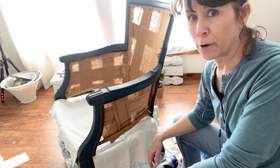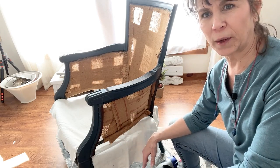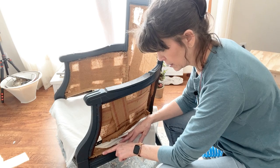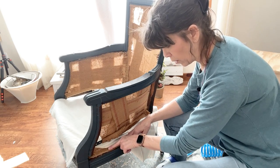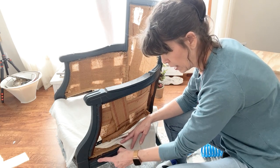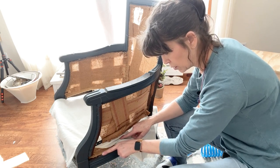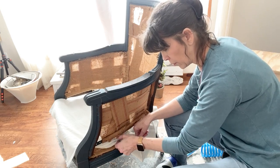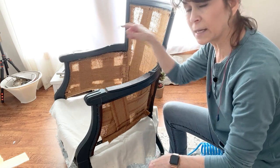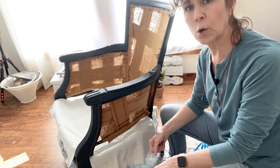I'm getting ready to fire up the air compressor — it's loud so I'll turn the sound off for you. Let me explain what I'm going to be doing first. When we attach this fabric to the frame with the air gun and staples, we are going to apply the staples along this edge where the burlap had been attached — not in the channel where the fabric will be attached. If we put it in that channel it would create too much bulk and we'd have too many staples there. I'll add a couple of staples to one side, then move to the opposite side creating a little tension — I'm going to pull it taut but not stretch it so much that it tears the fabric.